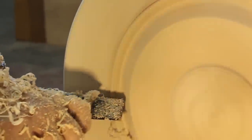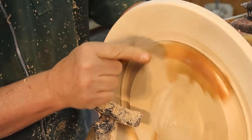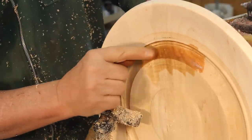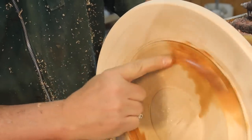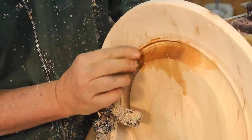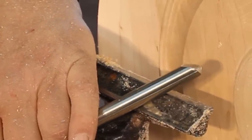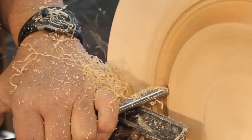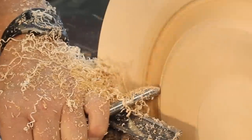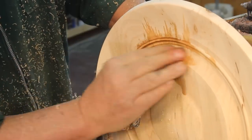This is going to be a raised bead — I'm cutting down the wood on the left and right side of it. I've got end grain on both sides giving me a little problem with some torn grain. What I've done is taken some mineral oil and saturated the two places where there is end grain to help stabilize the wood and hopefully cut a little cleaner. I'm using a small bowl gouge with a new grind, turning right at 800 RPM.